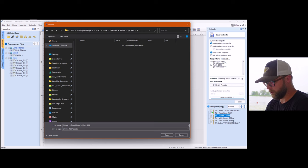Flip that project material. Insert four dowels into the index holes and align the project material to them. Screw that project material down and carve your back, bottom, roughing, and finishing passes, and any extras if you went there. Repeat the front slide process. You can choose to use four index dowels to line up your project material if you'd like, but it's not necessary.